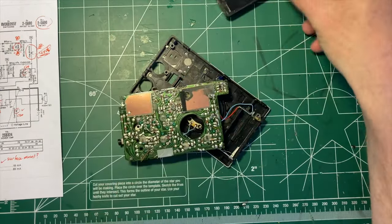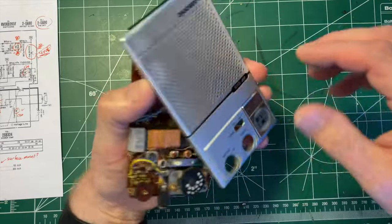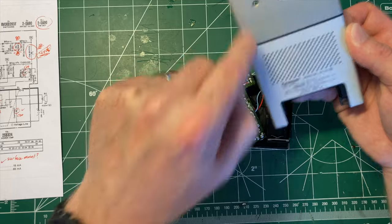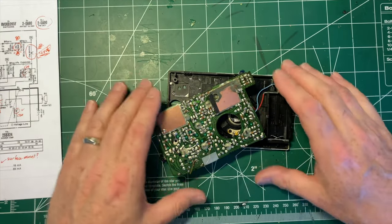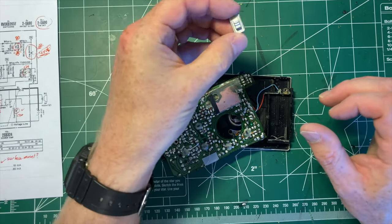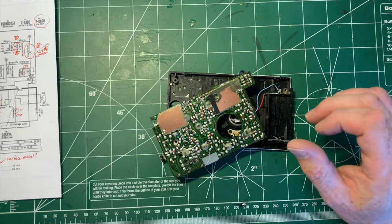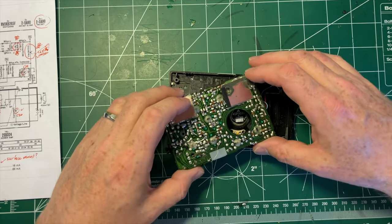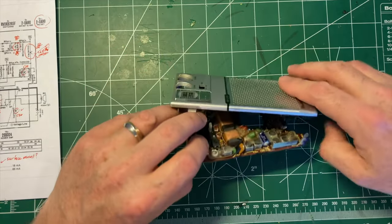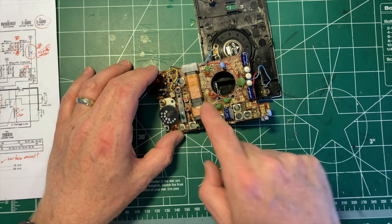It's important to remember to get both screws out — one in the bottom of the battery box and the other right there. If you get both screws out and the knobs off, you can then take off the band selector switch. Inside, I clipped off the antenna so it wouldn't get damaged. It's a bit interesting — they've been using what I think might be tantalum capacitors. Maybe those are the problem.